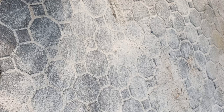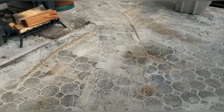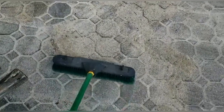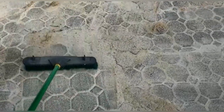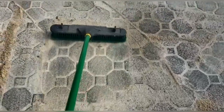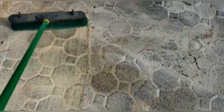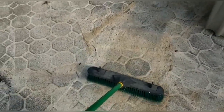So this is the last step for completing part one of the backyard makeover. So you guys, this is going to be me adding sand to the pavement that we have back here. One of the things that's been happening is that the pavement has been separating a little bit, and sand actually helps to keep them together. So I've been using just a big industrial broom to broom the sand in between the rocks so that they can set right. And once the sand is nicely covered all over the pavement, it looks really nice. So I just used the broom to do that.